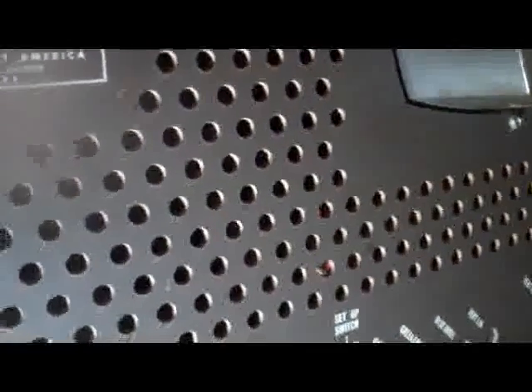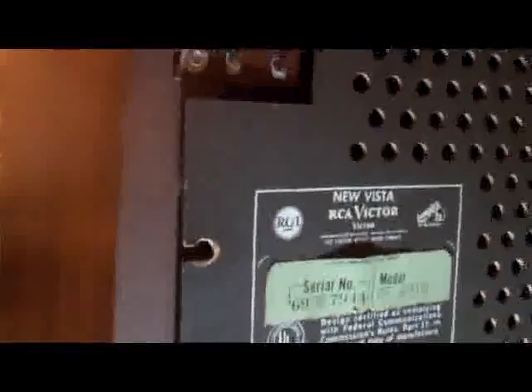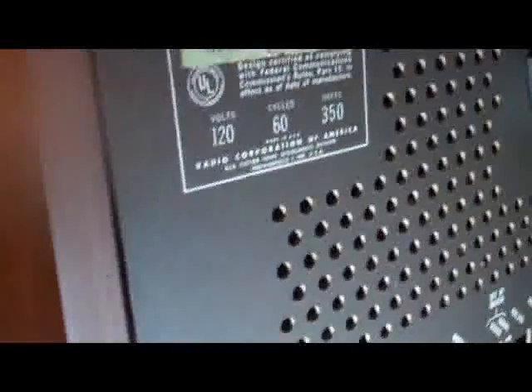We're pretty much in testing mode now — you can hear some fans running. I've installed three muffin fans on the bottom blowing up into the bottom of the chassis. I've also put some little wood blocks on both sides to space the bottom of the back out so that the flyback can get some ventilation, because this cardboard back sits right up against the back of the flyback. We're going to let it run for a few days and see how it works — the fans really help keep it cool — then put it into service and document what happens over the course of three months.